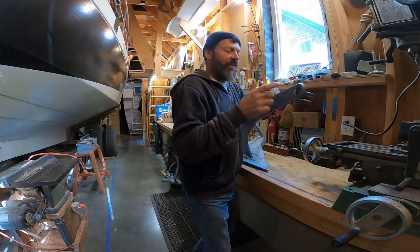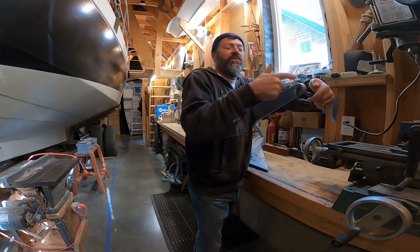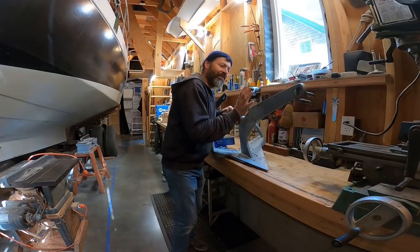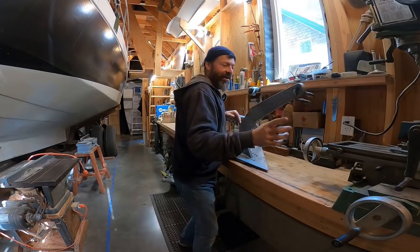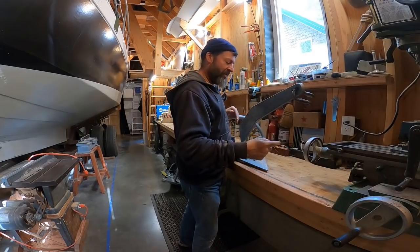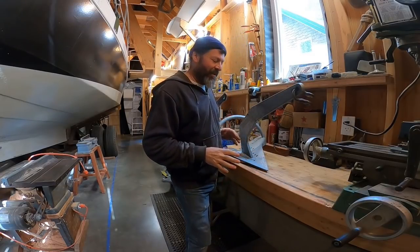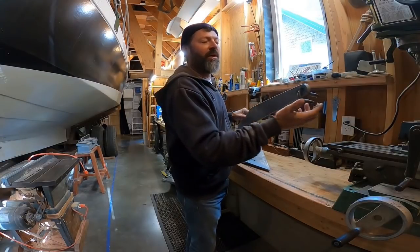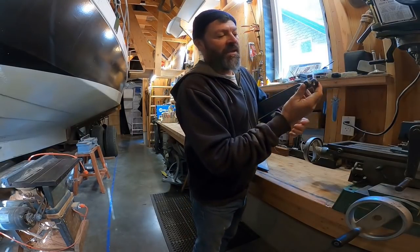As we saw in that cobbled footage, the shackle is jammed like this, putting the chain attach point effectively another inch or more in that direction. Coincidentally, that's also the same direction that the shank itself is deflected, about an inch. So all told, I say that chain attach point was a good 2 inches deflected from the center line of the fluke. And what effect that has, very, very difficult to tell. We did see, though, that the anchor was not working quite as well until it jiggled enough to get straightened out.